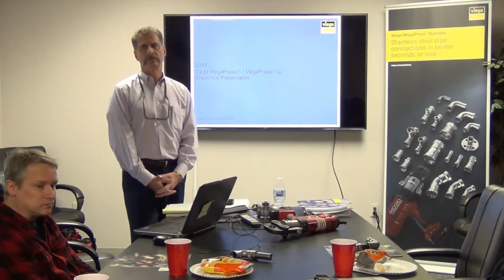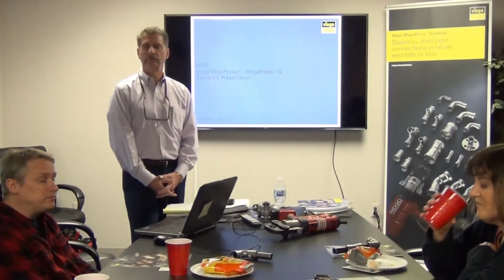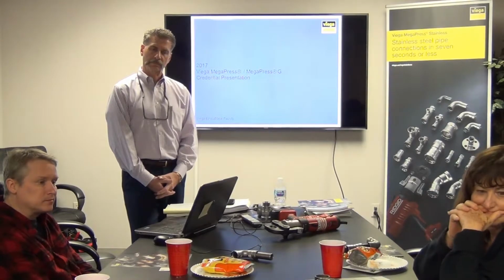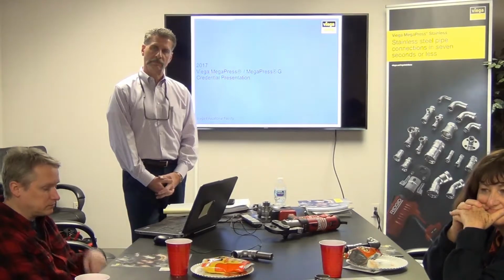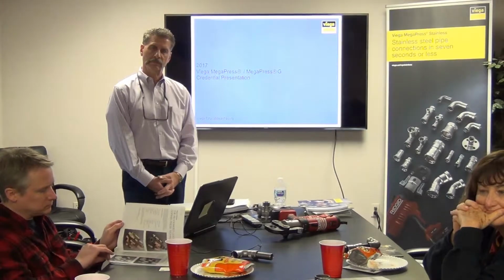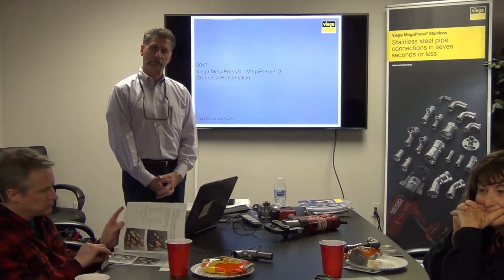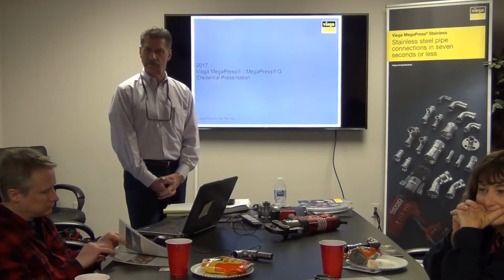100 times out of 100, a guy commissions a system, he's testing with water, he's going to know before he went home that day that he forgot to press a joint. That saves his butt so much. Other manufacturers don't do it the expensive way. What Viega does on a copper ProPress item is hydroform into the metal a little dimple behind the sealing element, so that if you forget to press a joint and you test with water, water wicks behind the sealing element and drips to atmosphere, calling your attention to it.